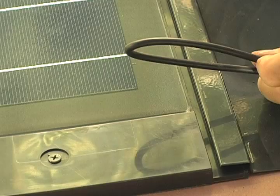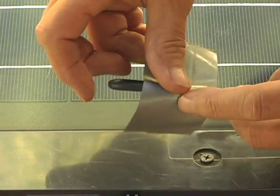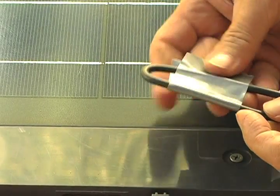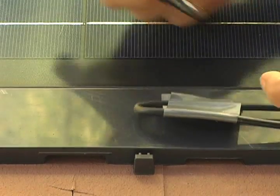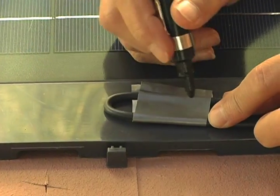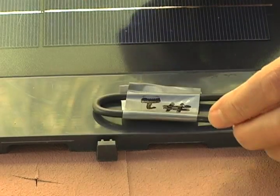Find the midpoint in the home run cable and make a loop. Tape the cables together and label them with the string number. This is where the cable will eventually be cut by the professional who will do the finished wiring. Again, make sure there's enough cable to reach the termination point under the roof where the final wiring will be done.